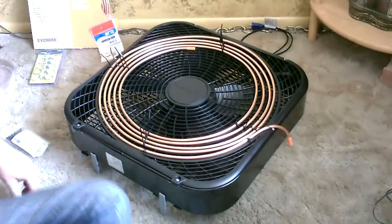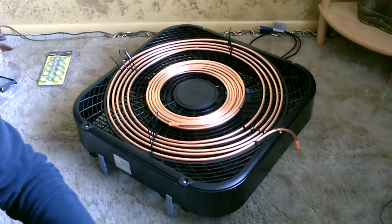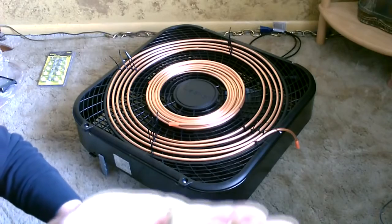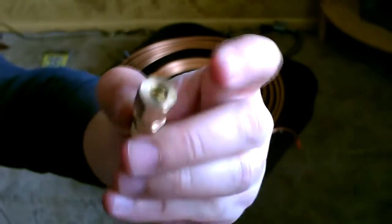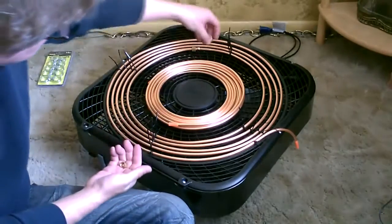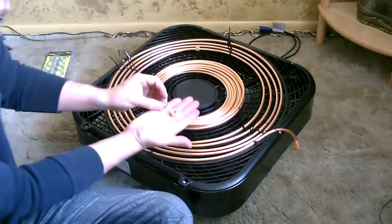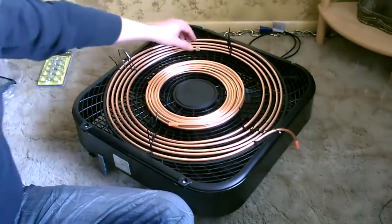Okay, there's the first piece. Now I'm going to hook the two copper pieces together — that's pretty simple. You just want to buy one of these compression unions for one-quarter inch to one-quarter inch. You've got the nut, the sleeve, and the pipe fitting on both sides. The nut and the sleeve just slide on the end, you put that up to there, slide this over and tighten it. Do the same thing on the other side — that's the connection, no soldering required.